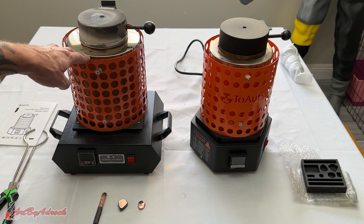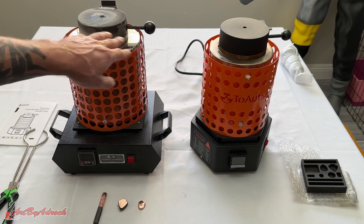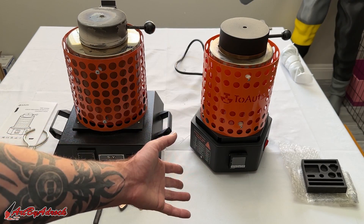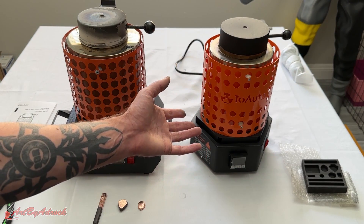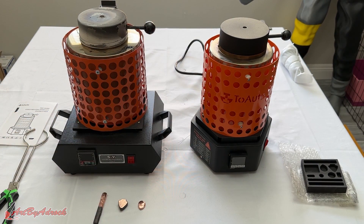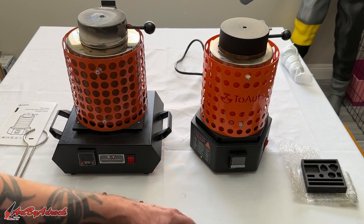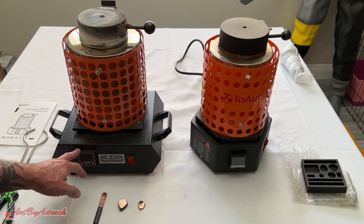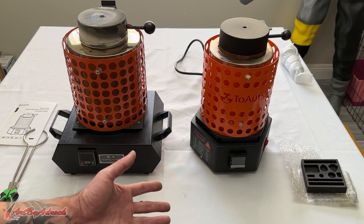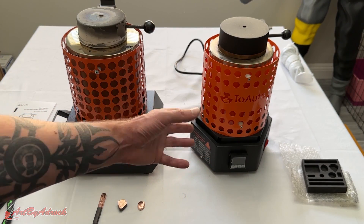To melt down copper in the old one it would take me a little over an hour, but this one took around 35–40 minutes to completely melt — it started melting around 25–30 minutes but for all of it to melt took about 40 minutes. The PID controller on the newer one is a little more simplistic and easier to use — they removed a few buttons you don't need. The newer model is 1,800 watts compared to the previous one at 1,400 watts, so it does heat up significantly faster. Keep in mind the furnace will reach temperature before the metal melts, because it still has to heat up the entire crucible.